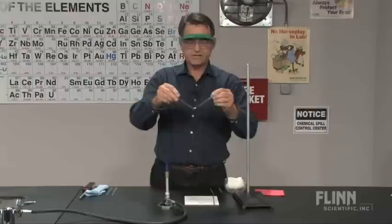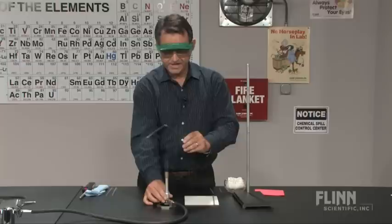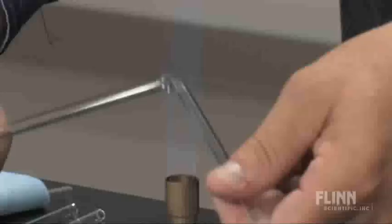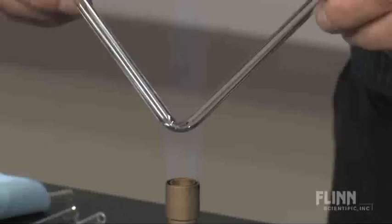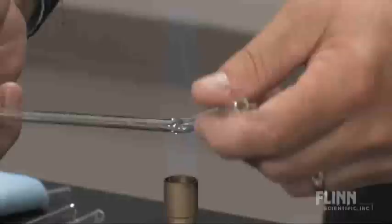Now you're not done with this piece just by bending it — you need to make the glass relax, as it were, by annealing it. With annealing, we take the flame, take some of the air out of it and produce a cooler flame. You'll see that inner cone disappear. We're going to take that and rotate the bend through there. This lets the glass cool a little slower than just putting it down on a pad, and it keeps it from stressing out and, when it finally cools, cracking. You'll do this for maybe two to three minutes. And of course, label it hot.